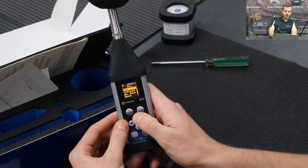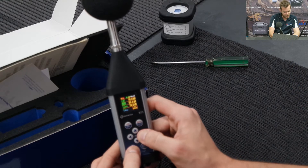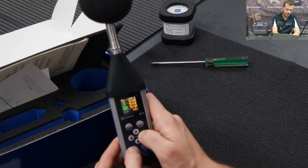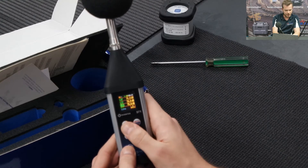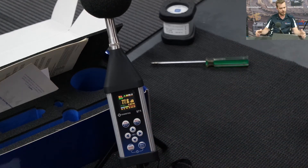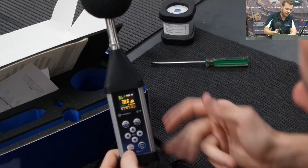Once set up the way you want, just press start on the instrument. As mentioned, you have three profiles running simultaneously. Using shift and the down arrow, you can change the display to show different parameters: LNs, one percent overall, times, peak values, max values, min. If you're on site taking an instantaneous measurement, you can change all of this — it's all interchangeable. Press the down arrow to see the same measurement with a larger display. Now I've got A Fast on the display. Whether you're measuring machinery, a dog barking, or whatever — you can see it on screen. All of this data will be saved to the SD card for download.